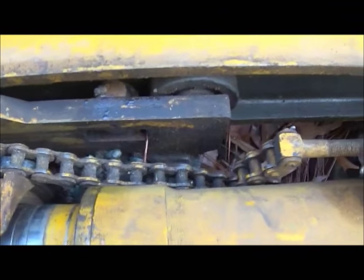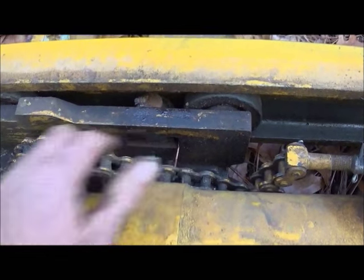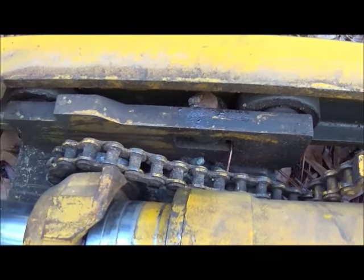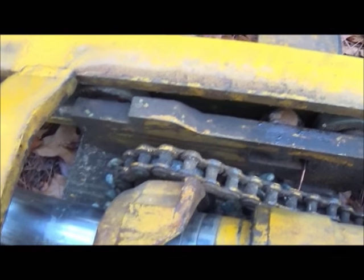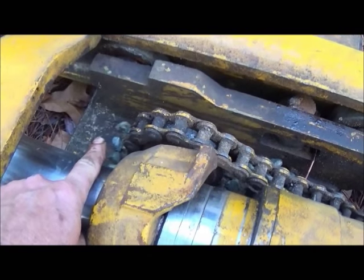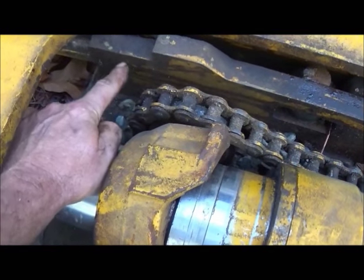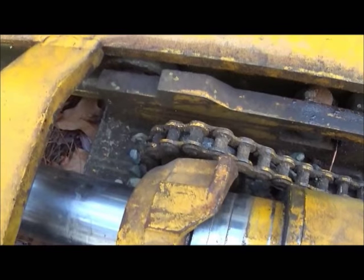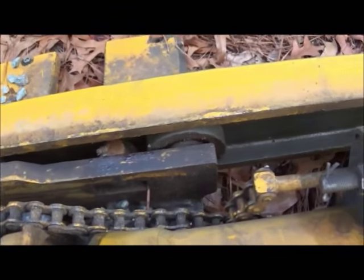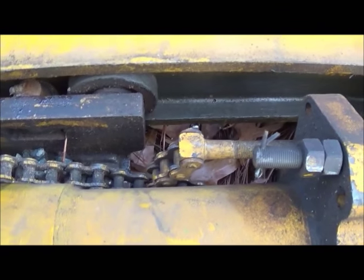And we'll just do it just like they've got it here, just a little heavier duty. I mean, four rollers instead of two, and two of these side rollers instead of one. And I'm sure that's going to be adequate to hold up what we want. And you can see they've got it welded on them plates. What I wanted to do, because we're not having a cylinder here in the way, is weld it to our big plate, and then we'll gusset it from here down. That'll keep it good and steady from bending this way, popping a weld or anything like that. And I think that's going to do us for strength-wise.